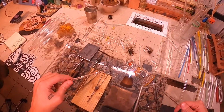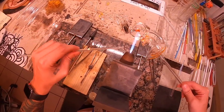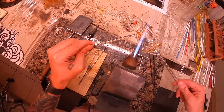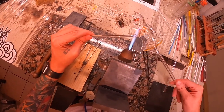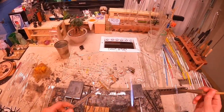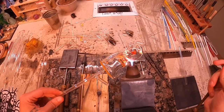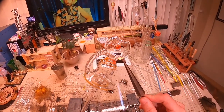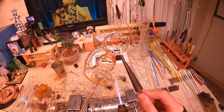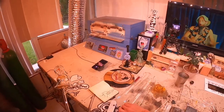I erased the footage for the first one, but you do the same exact thing on each side — it's like a mirror, so you're not missing anything. Whenever I pop a hole here, I pick away a little bit of glass on the bottom so that when you make the straight seal it doesn't want to kink. Sometimes you can get it too thick and it'll look kind of ugly, so I pick away a little bit of glass on the bottom using my brass reamer.